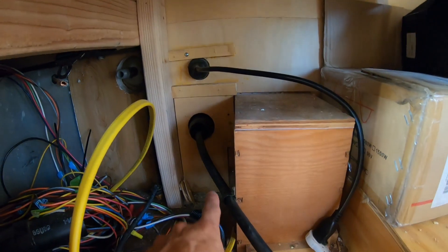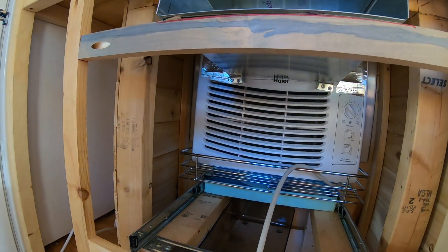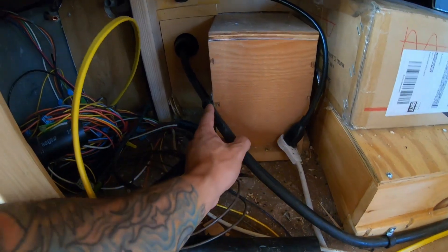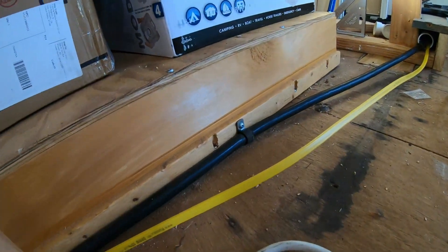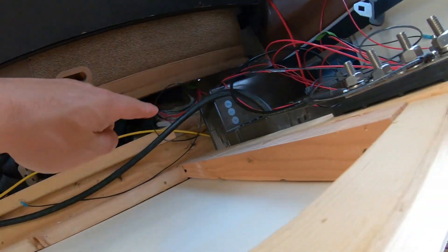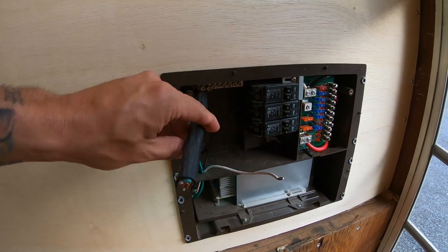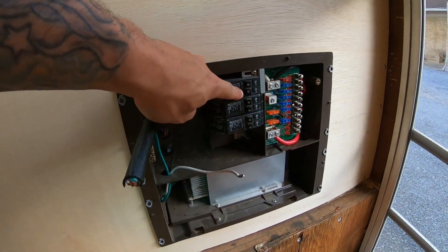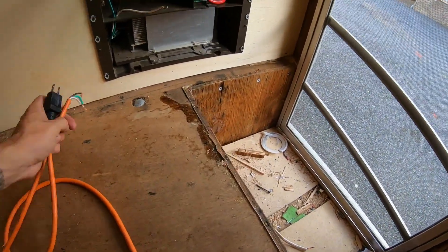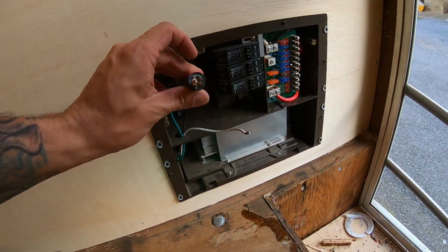I have my 30 amp and my 15 amp — the 15 amp is plugged into the surge protector which is running this air conditioner, so I have two sources of power. Here's my 30 amp wired in, got it snugged up, going through my loom, enters through here and up into the box. Here's where I'm going to make a pigtail to plug into this 30 amp. Right now all this is dead — I was running it off just a regular extension cord hardwired into the back, so I won't need that anymore now that I have the 30 amp connection.